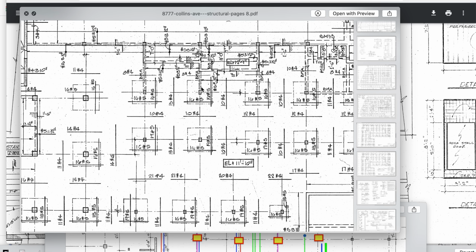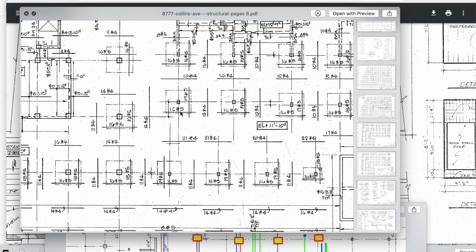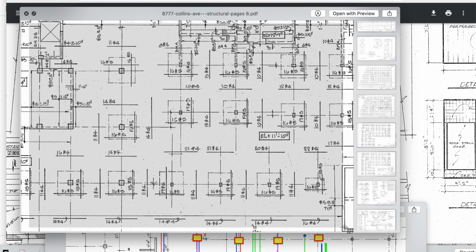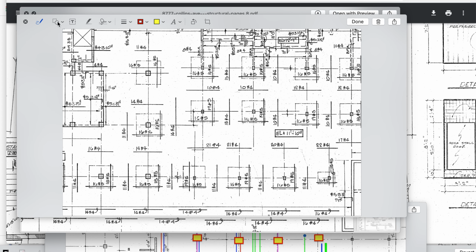This BMA being the mostly loaded BMA between all of these because it has a span of the weight of this one and the weight of this one inside this area here to take the loads from 2 sides, including the porches, the elevated porches. All right, tributary areas, offset columns, just a lot of craziness. So let's first talk about, initially they were going to run a BMA straight down here, remember, into the wall. So initially they were going to have a BMA all the way to the wall. And that would look something similar to this.